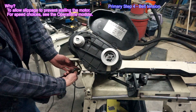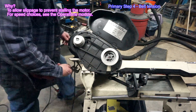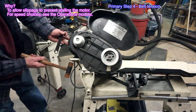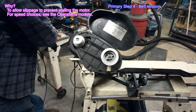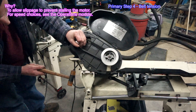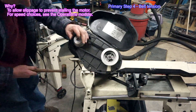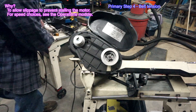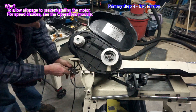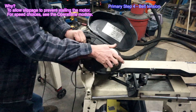If you have made the hardware upgrades and minor modifications, and of course you have the adjustments, it will so greatly reduce the potential to throw the blade that it is most likely it will stall the blade and motor instead. I have done so many times without damaging the blade. That's not a problem if you are standing at the saw and can shut it off, but otherwise it may damage the motor. Allowing the belt to clutch is a safeguard and here is one method to set it up.